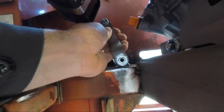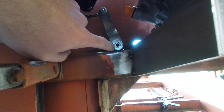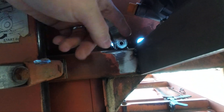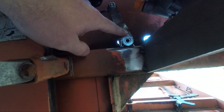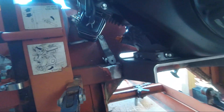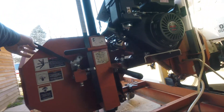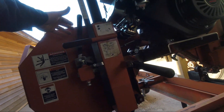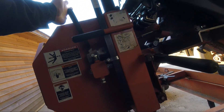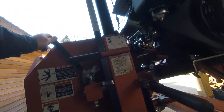The shaft that goes through here is actually a three-quarter inch shaft — it's a good tight fit. I turned it down to a half inch; there's an eighth of an inch lip behind here. Drilled and tapped it, milled a flat off, and this part here had a flat cut on it so it can't twist. So this rod is adjustable length and this tightens the belt. It can be adjusted for more tension. I think I may have to go to a slightly shorter belt, but I need to finish bolting the engine down to test that theory.